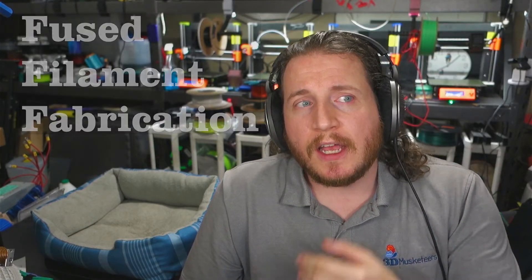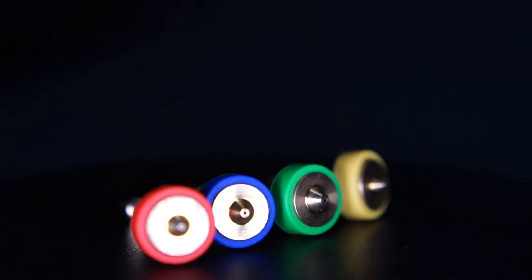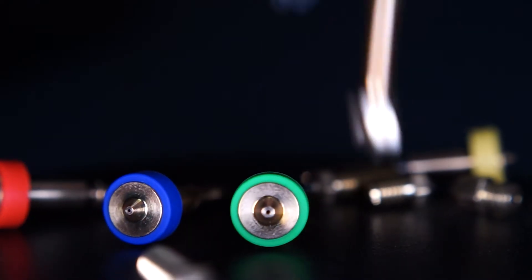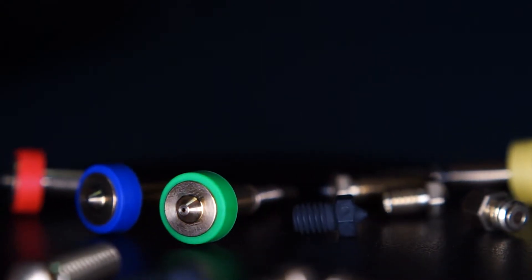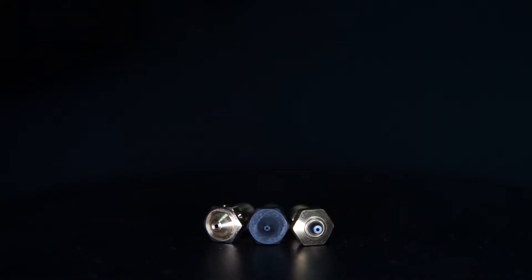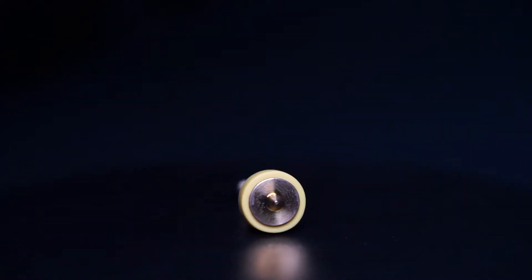There is a lot out there with 3D printer nozzles, but generally speaking, for a FDM or FFF 3D printer, your machine likely comes with a 0.4mm nozzle standard, and that's fine for 95% of the work that you would do. But if you are looking to get better detail, going down in your nozzle size can be good. But there does become a line of diminishing return, and we find that normally around the 0.25mm nozzle.